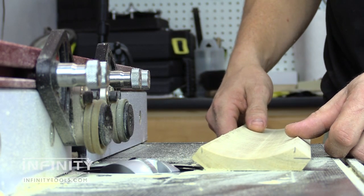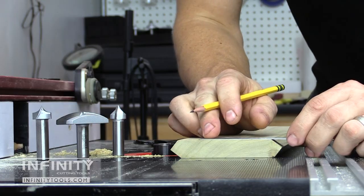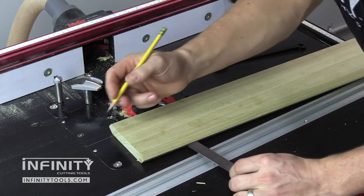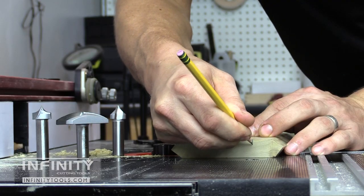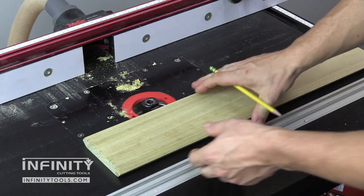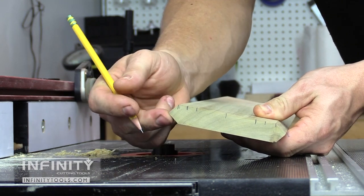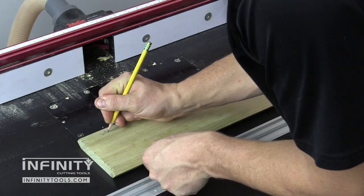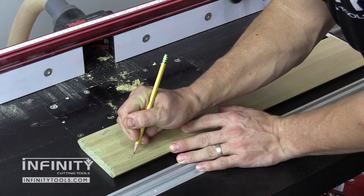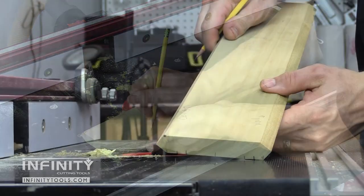For a complex crown, the method is the same as it is for a simple. We first mark the edges of our field and then mark the edges of the cutting diameter for each of the three bits we'll use to make the crown. Once we've marked the cutting diameter of each bit, we can mark the center line for each and use that center line to set up with the center line of each of the profiles. One thing to keep in mind when laying out the profiles for your complex crown moldings is how you want the crown molding to sit against the ceiling and the wall, and which elements you want at the top and which at the bottom. Because of the different bevels made by the crown molding edge bit, be sure to lay these out and label them appropriately so you don't accidentally put the profile you want at the bottom at the top and vice versa.